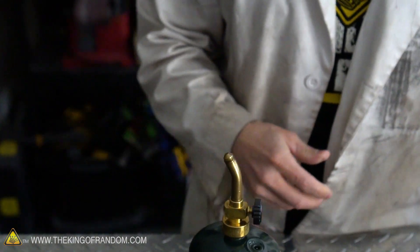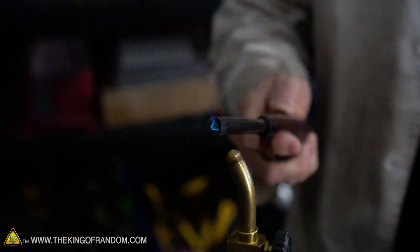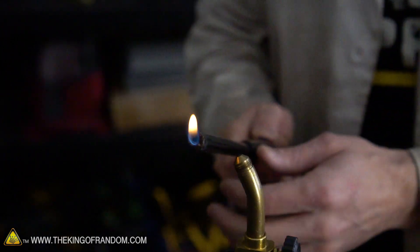What's really interesting is if we remove the sheathing from the nozzle, the flame actually goes out, and if we try to relight it, it won't work. The hole in the tip is so small it's shooting the gas out like a jet, and we're not able to light it even with a barbecue igniter — it whisks the heat away so quickly there's no time for ignition. So let's make the hole bigger.